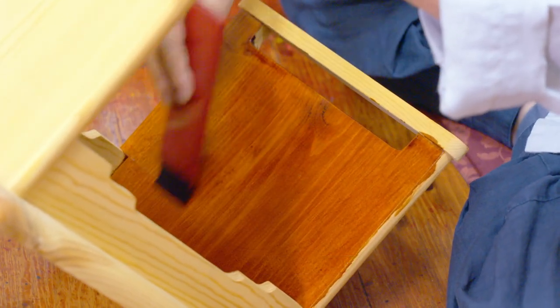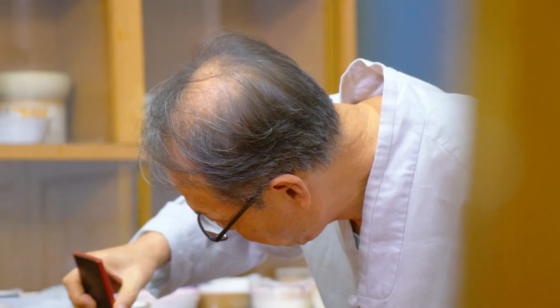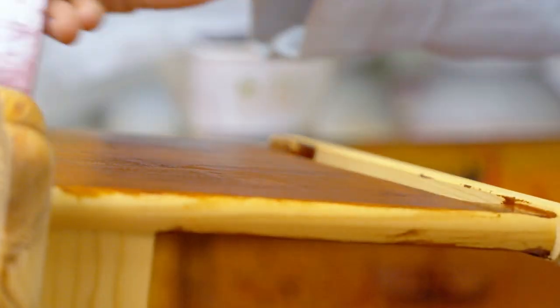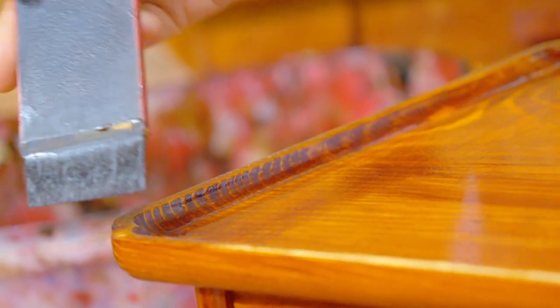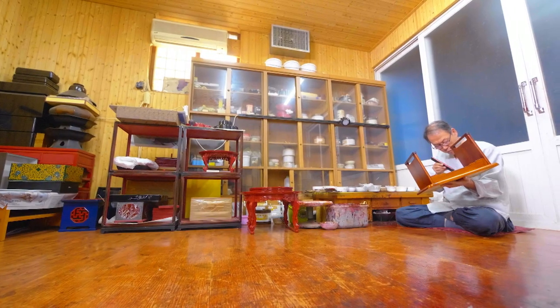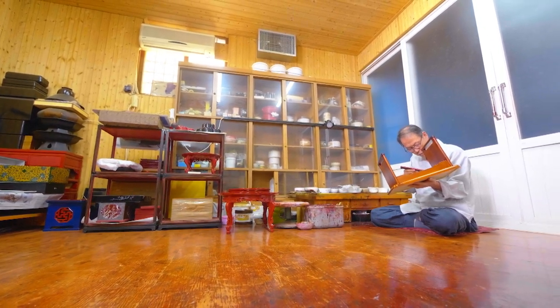Wooden ware is what the wood before the application of Ott is called. Ott is applied to the interior and exterior surface of the wooden ware. A watery coat of Ott sap is applied. Then it's dried for a couple of days and rubbed with sandpaper more than 8 times. Then a clear, reddish shine appears. The Ott sap, when it is dried and absorbed, causes the wood to become resistant to moisture and it gains antiseptic properties.